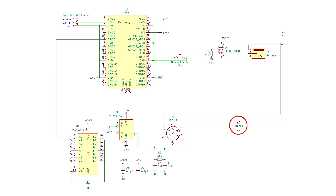That allows us to control power to the keyboard. There's also a series diode that provides reverse polarity protection, just in case you happen to connect the wrong kind of power brick. I used a 75176 differential bus transceiver to convert the RS-422 serial input from the keyboard to a TTL-compatible signal, and then a 74LVC245 bus transceiver to level-shift that signal down to a 3.3-volt logic level compatible with the Pico. I know it's totally overkill to use a 74LVC245 for this, but I had a bunch of them on hand. As for connectors, there are pin headers for the console UART and a debug enable jumper, as well as a 6-pin DIN connector for the NABU keyboard cable and a center-positive DC barrel jack for the external 9-volt power supply. The Pico's onboard USB connector is used for the host connection.